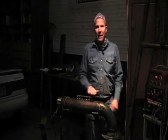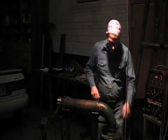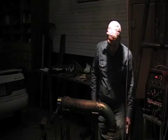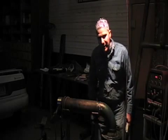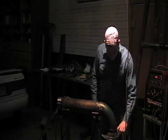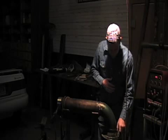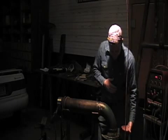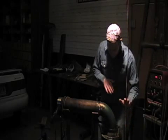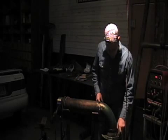I've got my pipe leveled — the flange is leveled with it because everything was done like that in the beginning when I welded it. Now I've got to level the face of my flange this way. I go off the face like this, that gives me my level this way. I'm level this way, I'm leveled. Everything is true now.